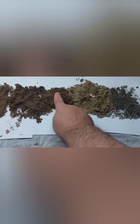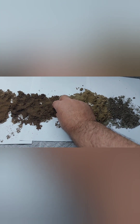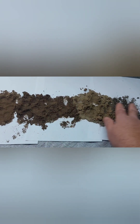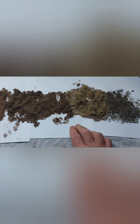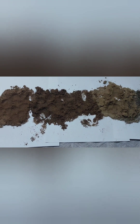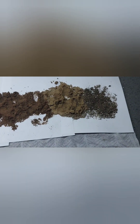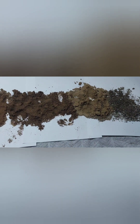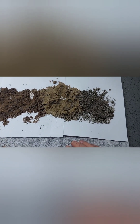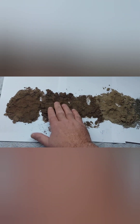This one's very popular up here — this is my local sand. But if I'm doing wider joints, I might add a bit of grit to it. So I might do two of these, one of these, and one lime. It depends what colour you want the job to go. Down south it's more of a yellow sand — some properties look really nice yellow. In North Wales we don't go for the white pointing; I don't particularly like white pointing on a property. So that's just a little example of the sands we get, and you can mix and match.